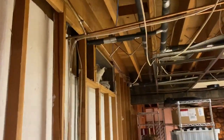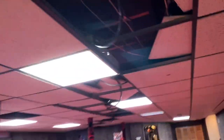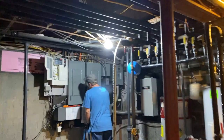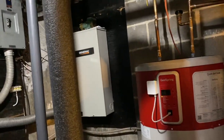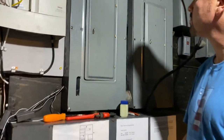I'm going to run the wire outside here, with the hole pre-drilled, and run the wire in the ceiling. Before I do a nice wire tie job, I just get it in here, come into the panel, come into the side, and make sure we turn the generator off before we do that — of course, turn the power off. Get the flashlights in and ready to go.